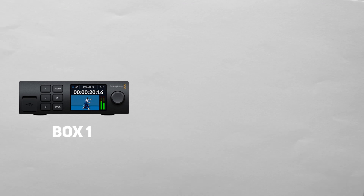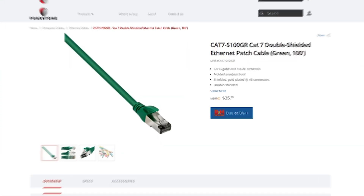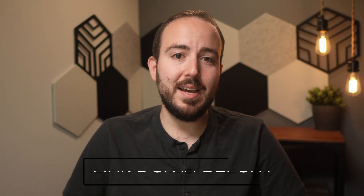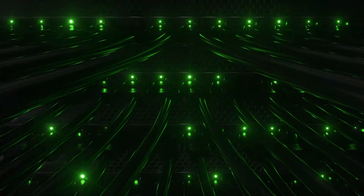Here's a simple overview of each of the boxes and cable run. On the left side, you'll see 2110 box number one — let's call this stage box one. On the right side, stage box two. The only cable connecting these two boxes is a 10G compatible ethernet cable. I'm using the Pure Stone CAT7 double shielded ethernet cable, and I'll link to that down below in the description. One quick note on powering these boxes: you'll need the common IEC power cable, or in more advanced setups they can be powered over ethernet.